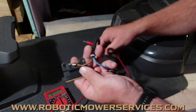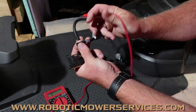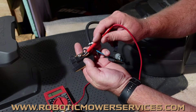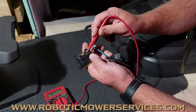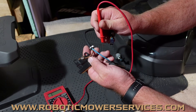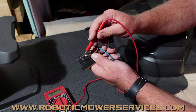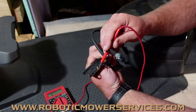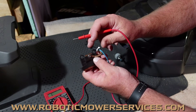Let me hold this up a little closer. So this is what I was saying — you would go from this connector where your brown wire is at, and then come up to the other end of the brown wire to this terminal that's crimped onto the wire. Test your continuity there, and if everything is good — like your one-ohm resistance — then you would go from this end to your screw right here, because this goes into and through that plate. That should be making contact and should have continuity without a lot of resistance.